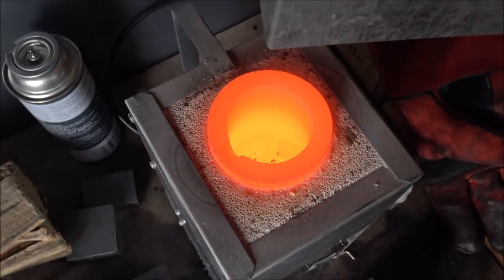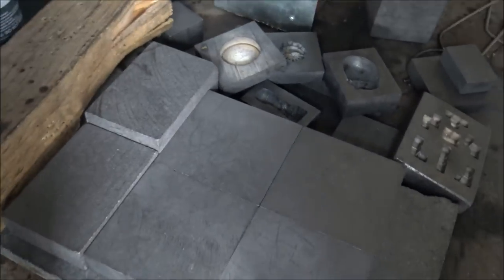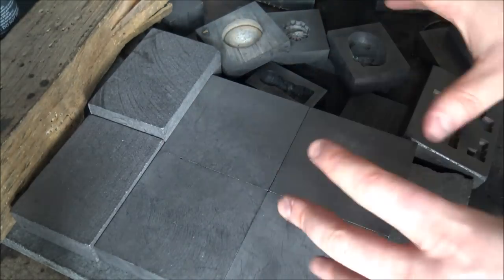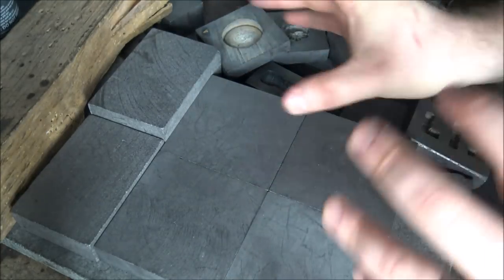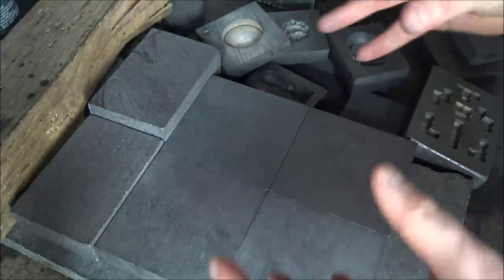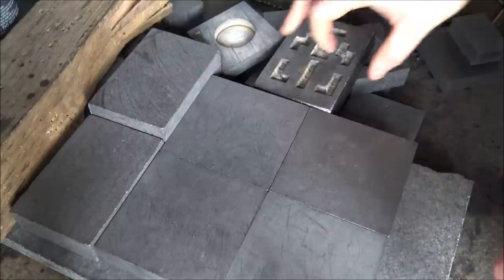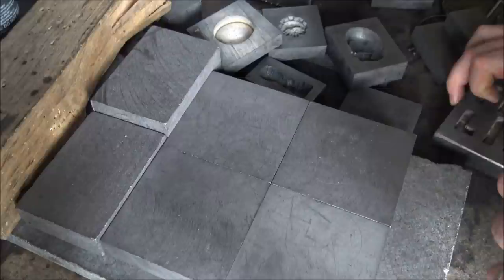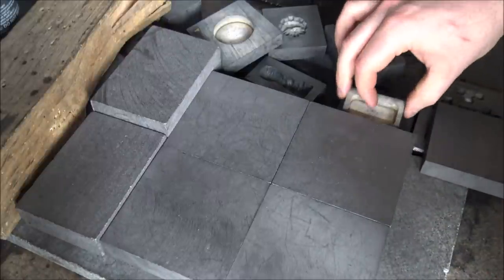I think it's pretty much melted, but we want to get it up to around 1030 degrees so that it is liquid enough that when we take it out of the furnace and put it up on here, it takes a little while to cool. It'll probably be only about 30 to 40 seconds for it to completely solidify, but that little bit of extra time gives a better finish and look than if you did it right now. So that's the general plan, and then after that, of course, we've got all the afterwork to do, the hammering and all of that as well. So that's the general process we're going to follow today for this 30,000 subscriber giveaway prize.